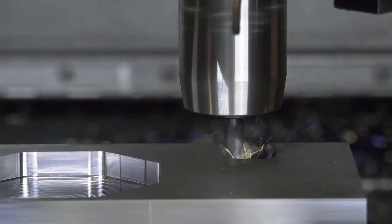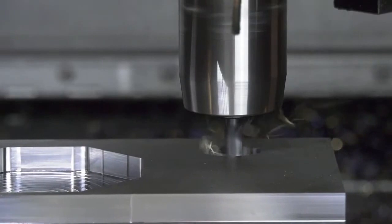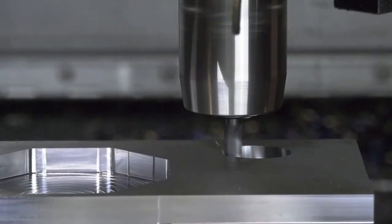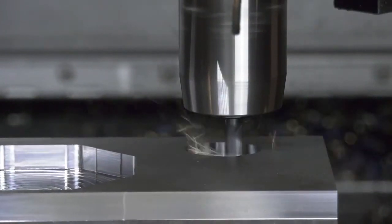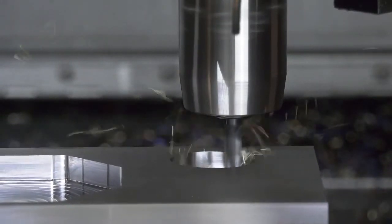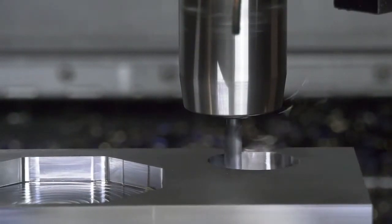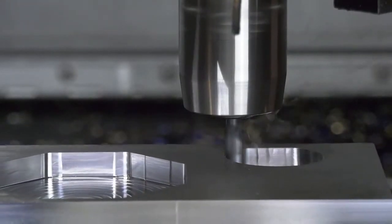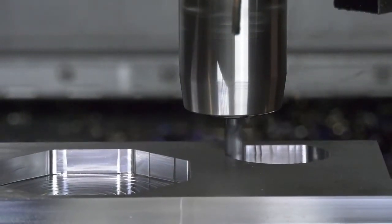To open up this pocket, we're going to be doing some dynamic milling, or high feed side milling. We're going to ramp up that cutting data to 550 surface feet per minute, 2 thou 8 tenths per tooth, at a 20% radial engagement to open this pocket up. All the features machined today will be at a half inch axial depth of cut, so your vertical depth is going to be at a half an inch.